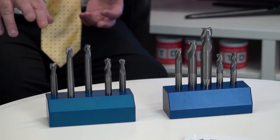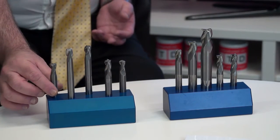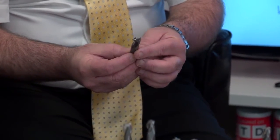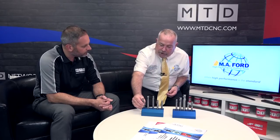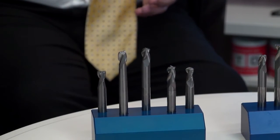Generally within the aluminium range it's two-flute and three-flute tools. This particular one here, which is our Series 135, is quite a unique tool in that most people who try to compete against it end up breaking the tool, because it will actually feed at up to two millimeters per rev in 1D slotting in aluminium. The big problem we've always found is the power to drive it and the holder to hold it.